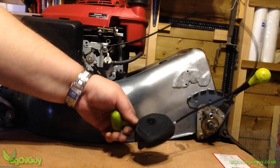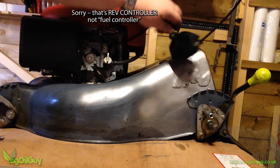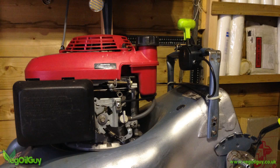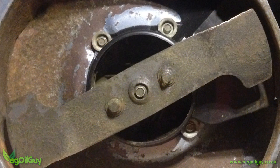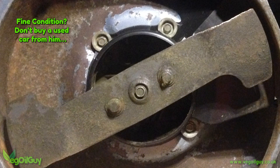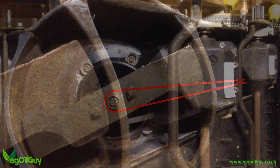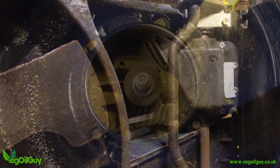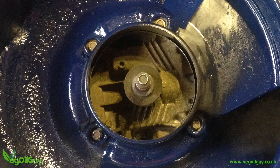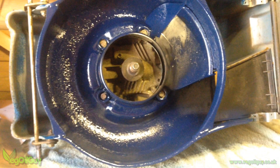The engine is a typical pull cord variety, and the fuel controller needed to be attached to something, so I used the old handle to make this shorter one, which I bolted to the body. I emptied out all the oil and petrol, then turned the mower on its side. Underneath was in fine condition, just a little surface rust. There's a belt hidden behind the blade that turns a few cogs in this gearbox, which in turn drives the wheels. But this was of no use to me, so I removed the blade, the belt and the gearbox.